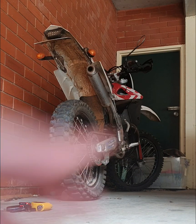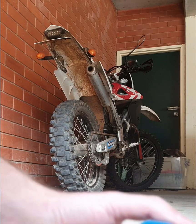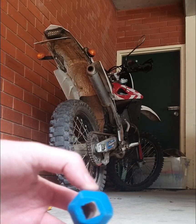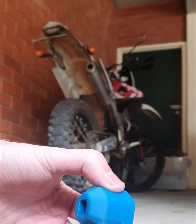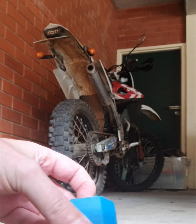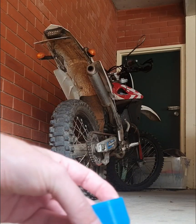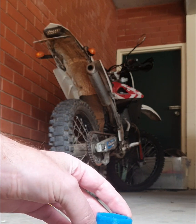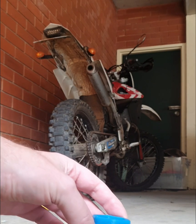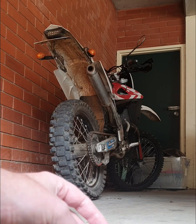After the first attempt, we're going to see how much torque my 3D printed sockets can handle. This one was printed horizontally to get a horizontal grain structure; this one was printed vertically, so that grain structure will be in shear — and I expect it to take less torque.